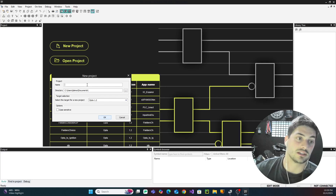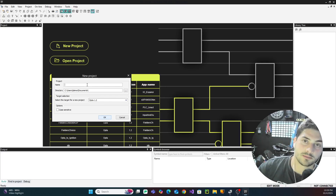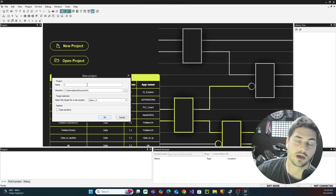The important thing is you design an overall system, make an IO list of the total inputs and outputs you're going to have, and you need to be able to add these modules to your PLC. We've been doing this tutorial series with the Arduino Opta PLC, so we're going to continue using that. Whatever PLC and system you have, your manufacturer should provide all sorts of recommendations for cards that support digital inputs, digital outputs, analog in, analog out, IO link, Profinet, high speed counter, RTDs, thermocouples — there are so many different variations.